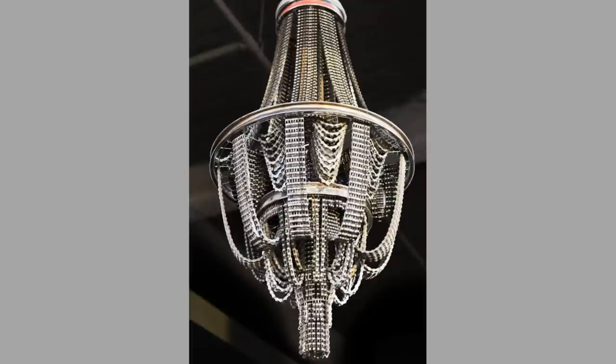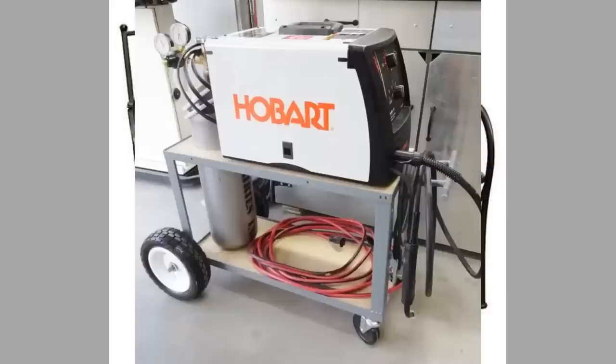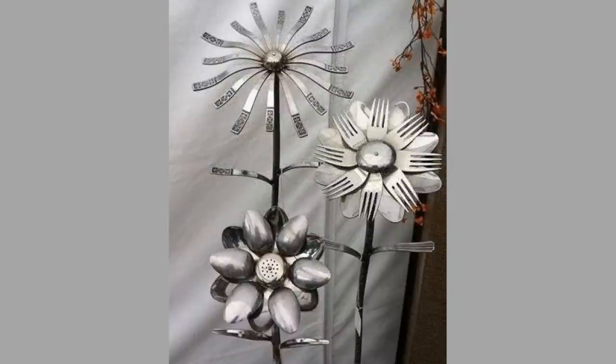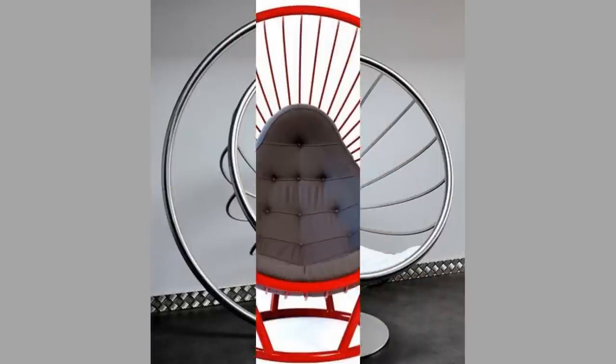A simple welding cart project is also a fun project. Metal carts are a great way to move your welder and cylinders and organize cables. In addition, they are easy to make. You need a cold rolled steel rod for handles, cart wheels, casters and support, metal strips, and angle iron brackets. Keep in mind that you need to draw a design before you start. Then you should make it big enough to fit your welder and everything you need. Once you make it, you can easily move your heavy welder.